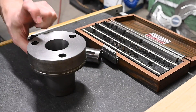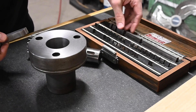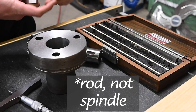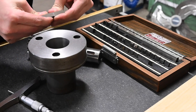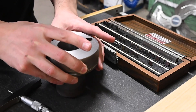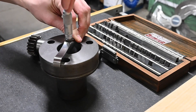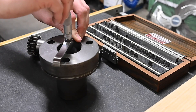We need to know the total height of this part. Rather than mess with changing out the spindle on the depth mic, we're going to use some gauge blocks. We've got machine surfaces front and top and bottom, with a known three inches there. Then I can drop my depth mic down onto those gauge blocks and know that I've got three inches plus whatever the mic reads.